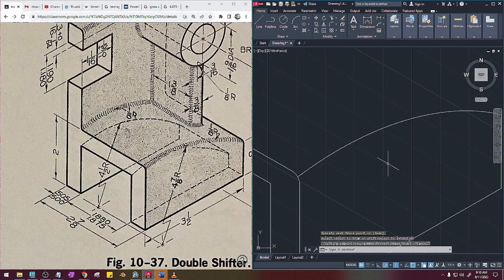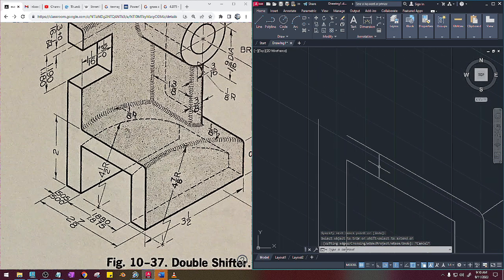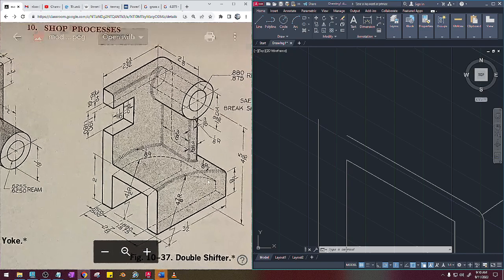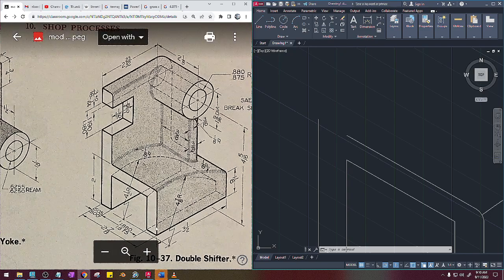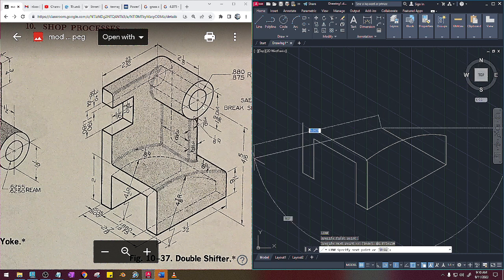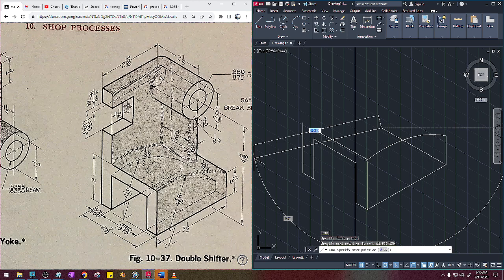So that's still useful. And then we're going to do the same thing here, but first we need to get to the top of the drawing so we can do the radius here, and then we're going to do one up here. Alright, now we're in this point. We need to go all the way to the back, so that's 2 7/8, which is 2.875 from this section right here. We're going to go to the back of the drawing, so 2.875 at 150, and now I need to get to the top of this section right here, which would bring me to this little X right here in the middle of those ellipses, and then I'll come back this way 2 1/8 right there.